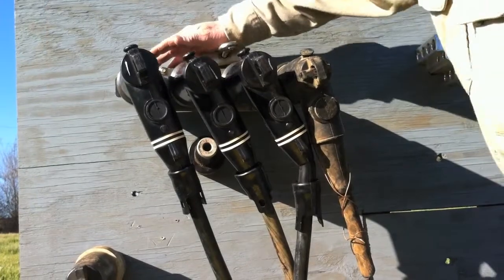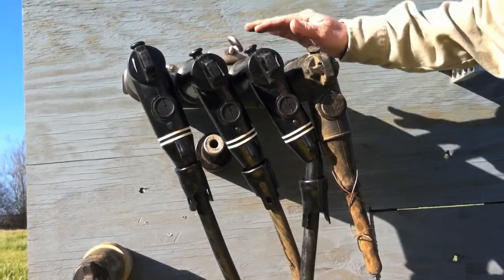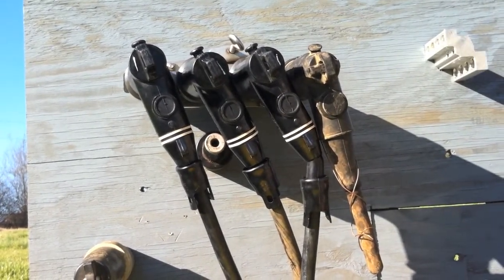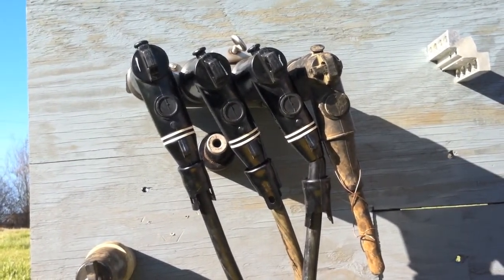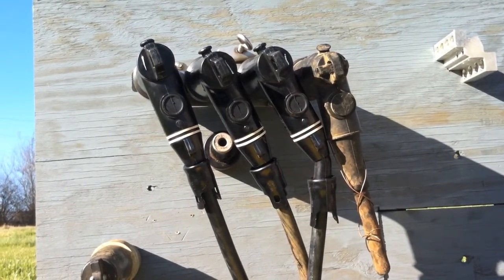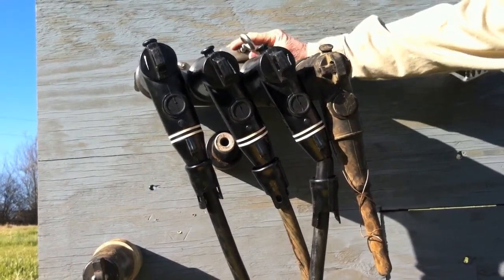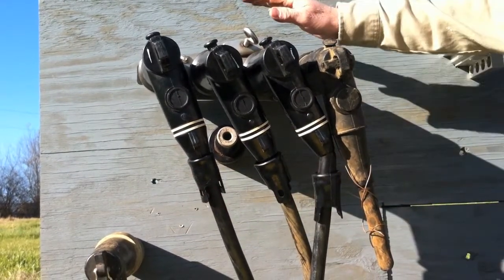I want to talk about here, we've got a 4-way adjustable junction, and we've got 4 cables on it. In this scenario, we're demonstrating if you need to cut into your underground loop. Right now we're having to splice in a switching cabinet and come in and out of it with the transformer. That's an added piece of equipment in people's yards that they don't like, and complaints from your customers. With this, you can just come in with your single transformer, your standoff bracket here, still standoff bracket here. Nothing's changed there.